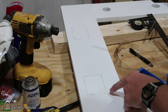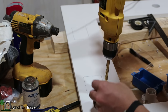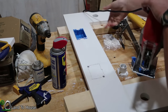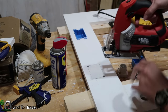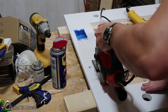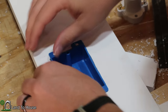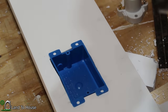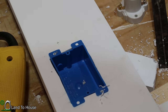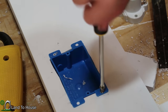I'm going to use a 3/8-inch drill bit to drill out two corners of this box opening so I can get the jigsaw into position. Now I'm going to take my jigsaw and cut out the form I've made. I went ahead and did a test run on the other one and it worked out quite well. Good snug fit — I like it. Now that the boxes are in, I'm going to put some screws in there to prevent them from coming back out, using fairly small pilot holes and small screws to keep this from getting pushed out later on.